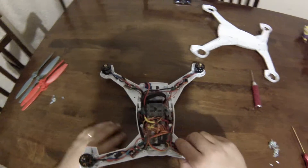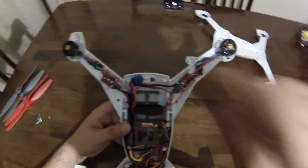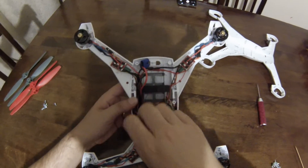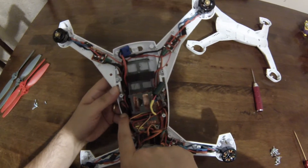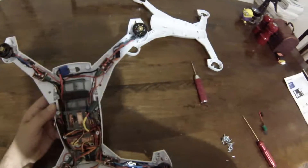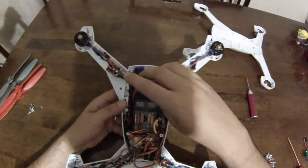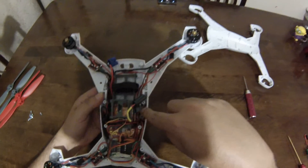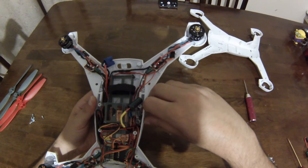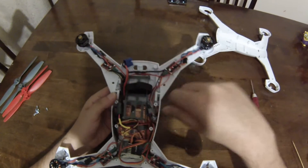The steps I took: I removed the main board from here — that's usually where the main board sits. I trimmed it to only leave the portion where the ESC wires connect, which is now just that small piece here. You could leave it at the bottom to use it as a distribution board, or not — it's really totally up to you. On the other side there is a cheap 3-amp BEC from Hobby King, and a Glitch Buster here.